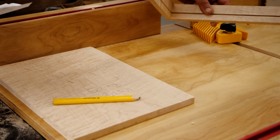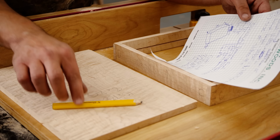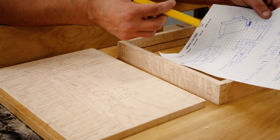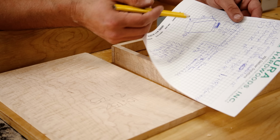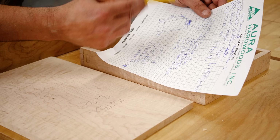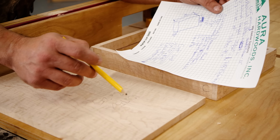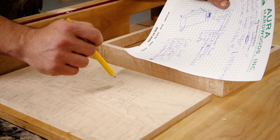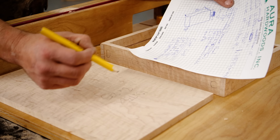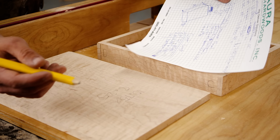Okay, so we have our drawer box done. I just kind of roughly put it together here. And we know our inside dimensions are 10.35 by 8, and that's taking away the 1/2 inch material. But then we added 1/4 inch around each side because of the groove. So I could technically go up to 10.85 and 8.5, but I'm gonna do 10.75 and 8.25